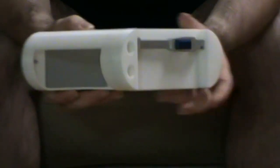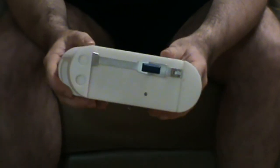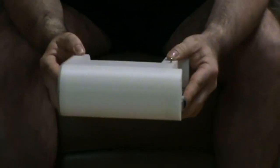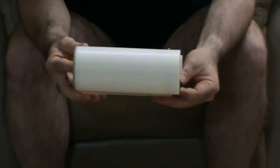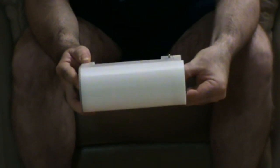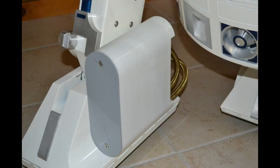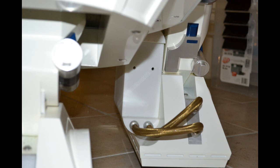I've yet to paint these yet. I've got to give these a bit of a light sand, put some spray putty on them, sand that a few times and build up the layer to fill in all the imperfections, and then I think it should look pretty good. I've already had these on R2 and I've got some photos of what they look like. They look pretty good and they're pretty sturdy. When the batteries are installed onto the feet, you can see they're nice and tight against the curve with no gaps. And when R2's driving around, the battery boxes don't vibrate at all — they're really good.